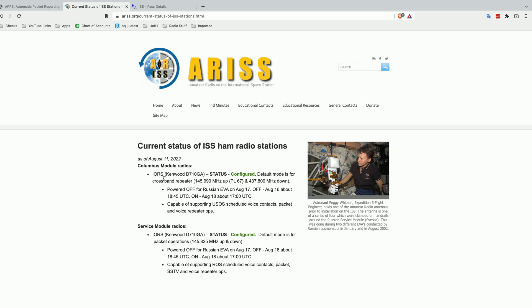There are two radio stations on the ISS. In a previous video we talked about the voice station where you can talk to people on the ground through the space station, and very frequently some of the astronauts have been popping on to say hello as well. But today we're going to be using the data radio, which is used for packet operations and is going to be operating at 145.825 megahertz, both for transmitting and receiving.